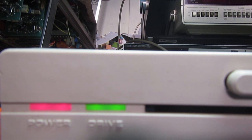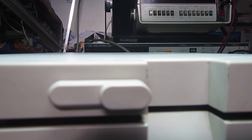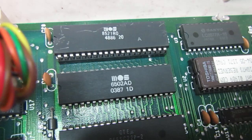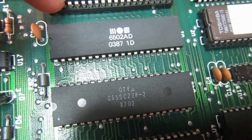The first symptom of this one is probably CPU not resetting. The green LED never goes off and the model runs forever. I checked the reset pin 40, pin 39 — the clock is okay — and pins 37 and 3, the output of the clocks.